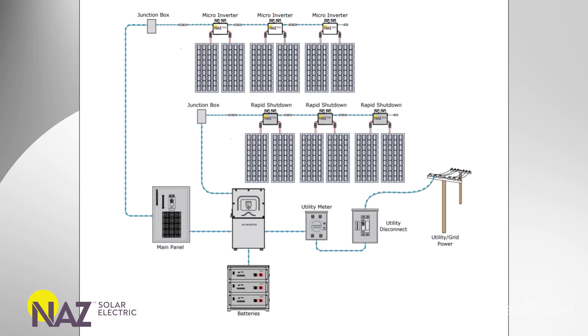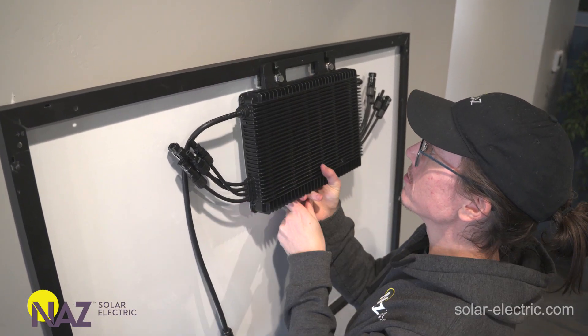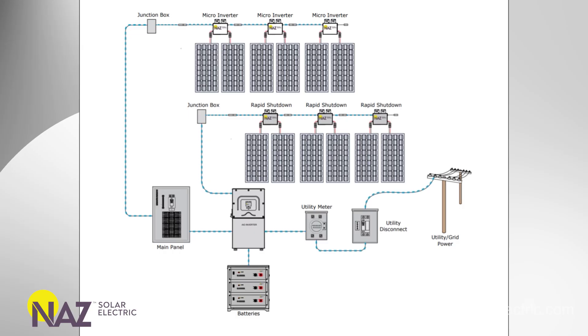Now imagine if you combine these two things together. If you have an AIO inverter that offers both AC coupling and DC coupling, you can have full control over the DC coupled solar array and significantly offset your AC loads with AC coupled power. This makes for a very efficient system because PV inverters are incredibly efficient at inverting PV power and offsetting loads, while DC coupled solar is really efficient at charging batteries. So if you have an ESS system with a bias toward heavy AC loads like air conditioning or pool pumps, you can use AC coupled and DC coupled solar together to maximize system performance.